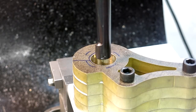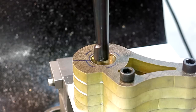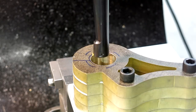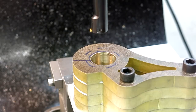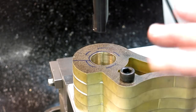I'm going to set this close to the edge of the hole and just kind of lock the quill for a sec, and then I'm just going to run it out until I make a little scratch. You need another hand or you've got to have the quill lever in the right spot. I'll make a little sound. I just scuffed the bore there, so I know I'm close to my bore diameter.